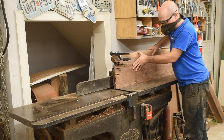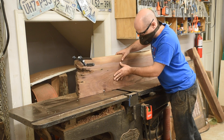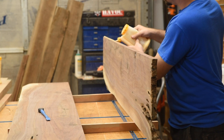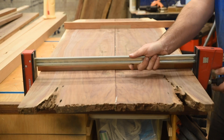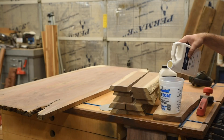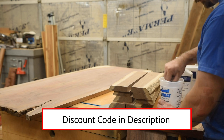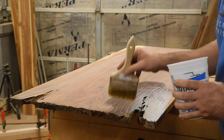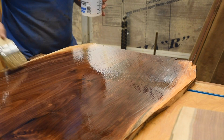Before gluing, I clamp the boards together and run them over the jointer. Doing it this way cancels out any deviation from square in my jointer fence, and it's seldom perfectly square. Then I apply some glue and get to clamping and using cauls. If you want all the details on my panel glue-up process, I'll leave a link below to my video on that. After the glue dries, I move on to stabilizing the rotten and punky sections of wood. For that, I use some TotalBoat penetrating epoxy and liberally brush it on. It doesn't soak into the good wood very much, but where the wood does suck it up, I keep reapplying until it stops. After it dries, off-camera, I sand it down before moving on to finishing.